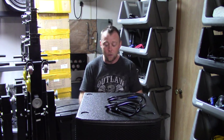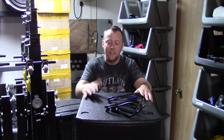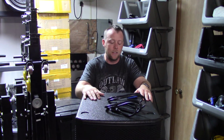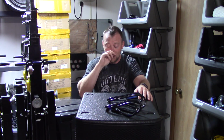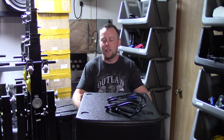So, audio 101, or maybe speaker building 101, sub building: put a high pass filter in. Not everybody's going to buy the matching tops to your sub. Now, if you watch my other videos, I'm a big fan of having matching stuff, but for the IP500s, I needed a sub, so it's not going to match.